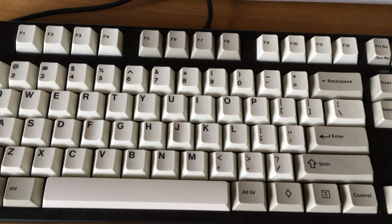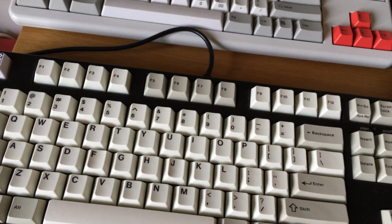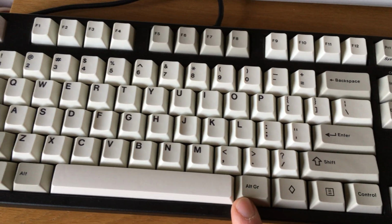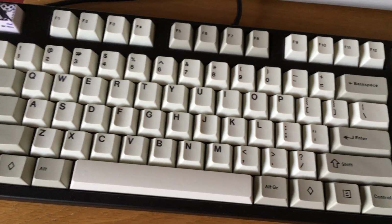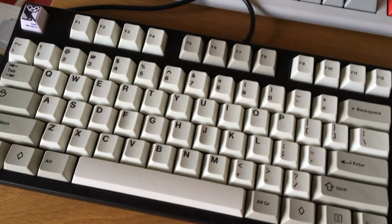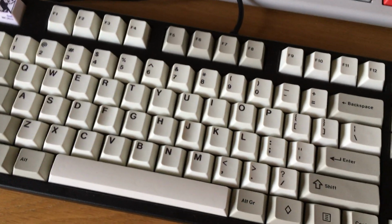and hook them into a piece of wire, which seems like a lot of faffing around to me. And unfortunately, with every keyset I was trying, including these Cherry caps, but also SAs and DSAs, PBT and ABS, the little plastic mounts were just sliding right out, which is completely maddening when you're trying to put it back together. You're trying to fit into a piece of wire and the things are sliding around. Apparently, you're supposed to use a bit of PTFE tape or plumber's tape. You wrap that around the wee stabilizer insert, and it does actually bung in quite nicely.